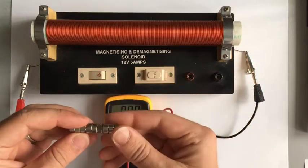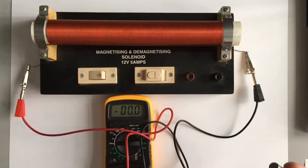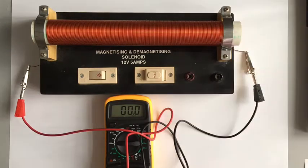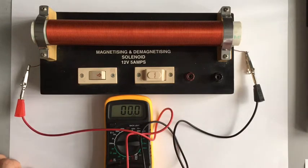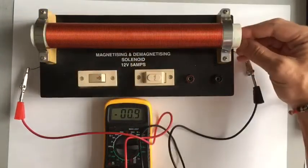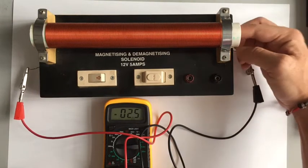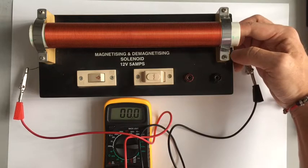I also have a magnet — quite a strong magnet, not like the one used in the last video. I'm going to put the magnet inside the coil and see what happens. If I just leave the magnet inside the coil, you can see there's no voltage produced. But if I move the magnet inside the coil like this, you can see that I'm generating a voltage.